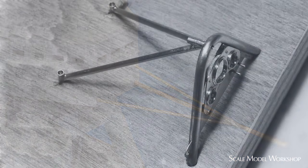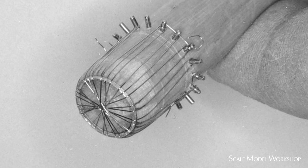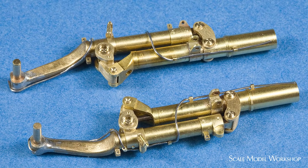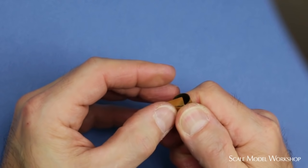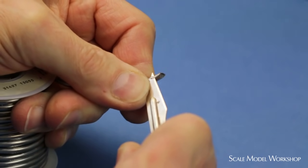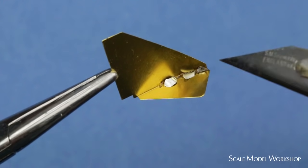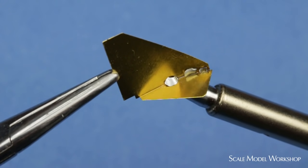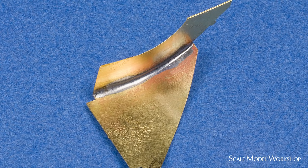There are any number of ways to hold the pieces together during soldering, from ready-made adjustable holders all the way to custom jigs. Just keep in mind that the way the parts are held together might draw heat and therefore increase the overall heat necessary. With a lot of photo etch, the parts are bent to place and only need to be secured. In the case of this photo etch tank fender, the two pieces are bent to shape, but the result is a pesky gap between the side and the top. A small amount of flux is applied in the areas where you want the solder to flow, and several bits of solder are shaved off and placed in the area of the joint. The areas not touched by the flux are oxidized, so that acts as an anti-flux, preventing the solder from flowing where I don't want it to go. All this minimizes cleanup later.